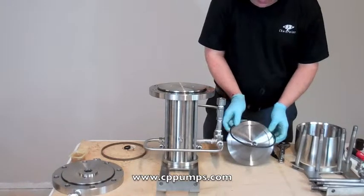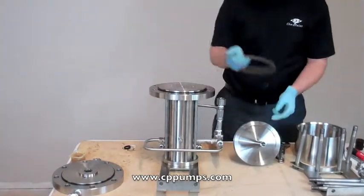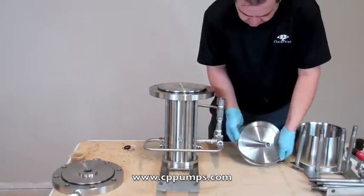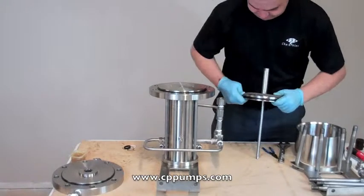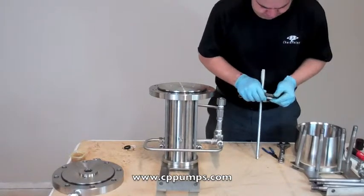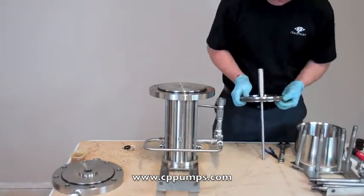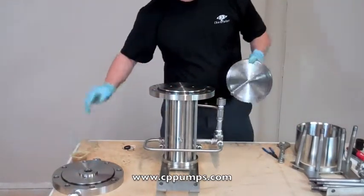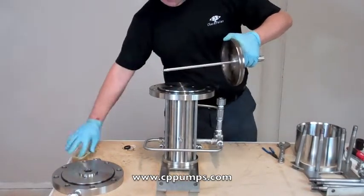Applying the piston o-ring can be a little bit tricky. You want to go from the top here and just slide it around. Take the o-ring seal, press it on one side and guide it around as far as you can. When you get to that point, fold one in and push it over. Make sure it's seated evenly all the way around. We want to grease our rod, but make sure to stay away from the vent holes right here — you don't want to clog those holes.